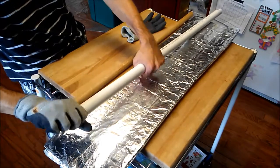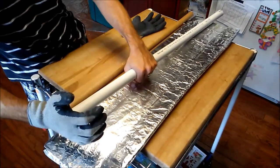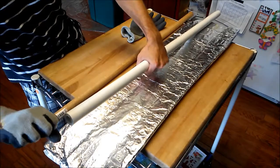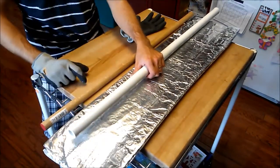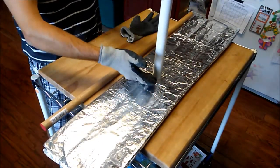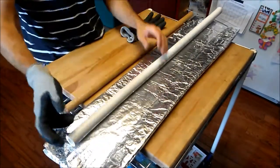But torsion, I could apply quite a lot of torsion. I could only apply so much force in that direction, but I was able to apply enough to get it slipping once I twisted it. And once you twist it, then I could also force it in up until that point when I didn't have enough purchase. It was still hot enough so that I took the pipe then, took it outside onto my deck under the corner, and just BAM! Rammed it in there like so.